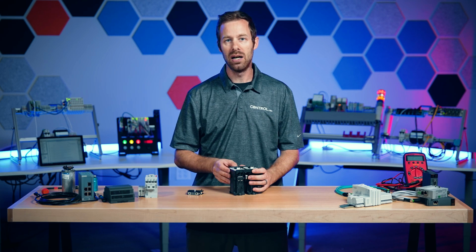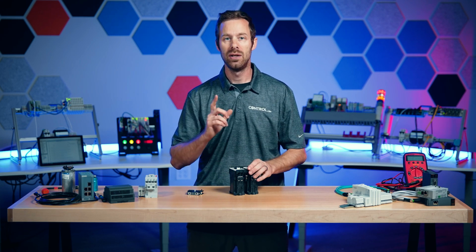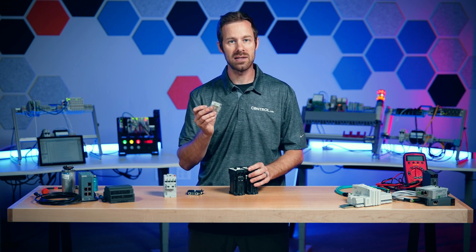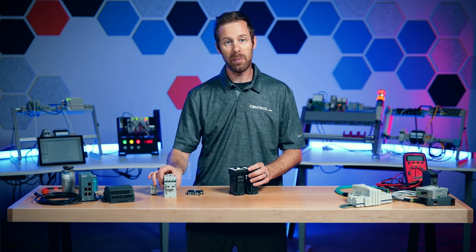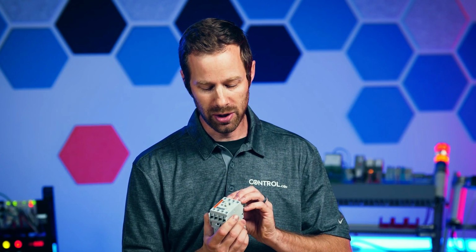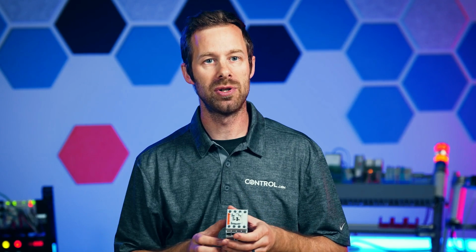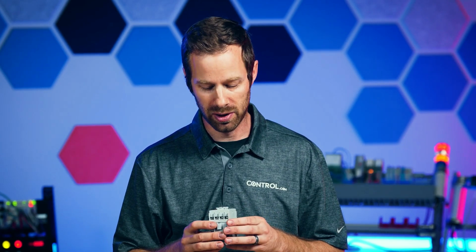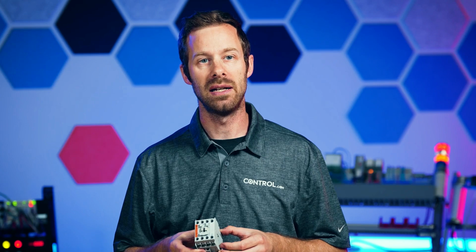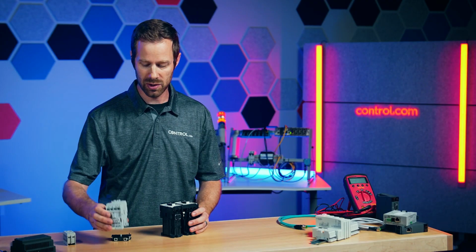If it says NO, shouldn't you be able to use that as another power conductor? No. The size of these auxiliary contacts is not designed to handle the amount of power rated for the contactor. When there's 3 power terminals, you use those 3 power terminals to supply power to your load, most likely a motor. Do not use the other auxiliary contact set to supply any sort of load. It's meant only for a feedback control signal.